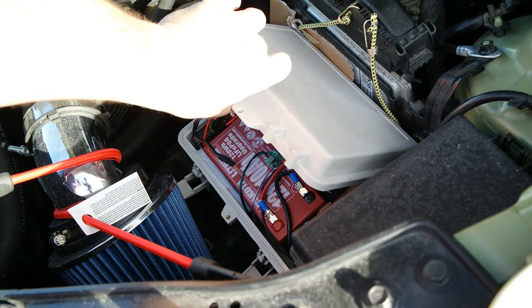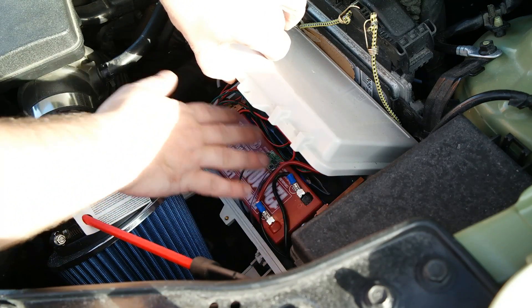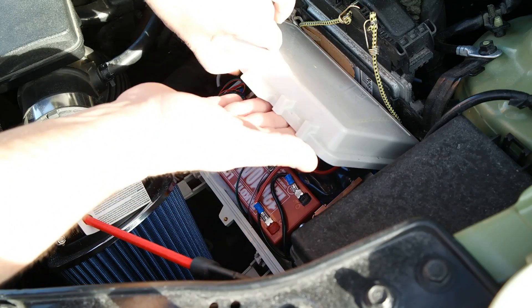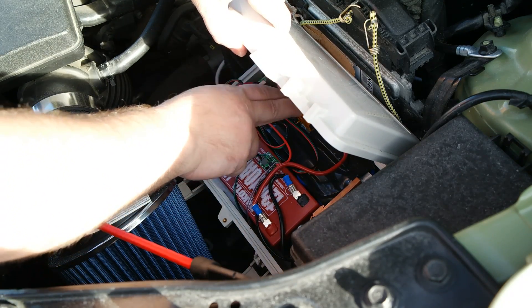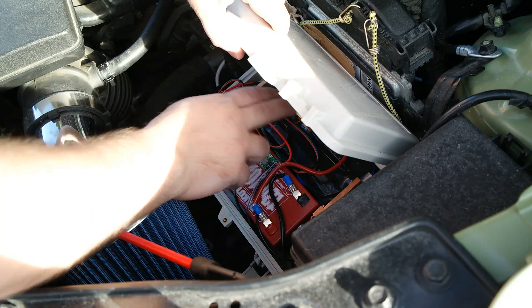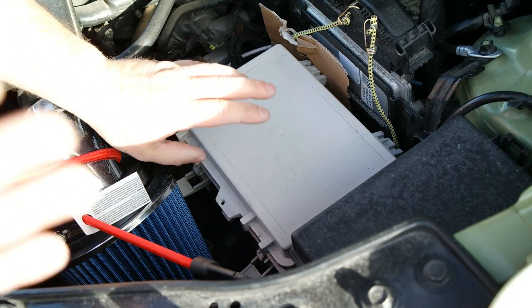Now, no one actually has to do this monitoring and make it massively complicated if you don't want to. All you need is a good case to protect the unit itself, the battery, the capacitors, and the charge-limiting and discharge-limiting resistor, and you have a working system. You don't need all this extra stuff — that's just for me. Design-wise, I'm pretty much going to call this project done.